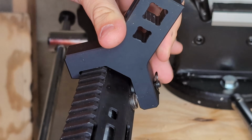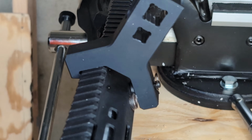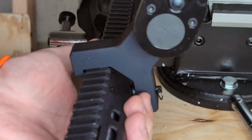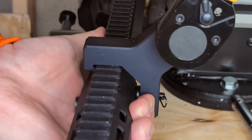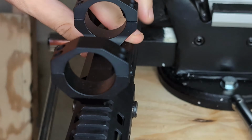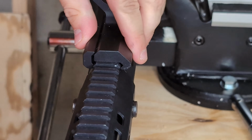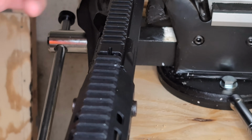All right. So we're going this way. And then I'll set this guy to about 70 foot-pounds. And I just want to keep a hand underneath this while you're doing it so it doesn't bend forward, because the Geissele reaction rod, the shank of it's actually pretty small. And that looks about right. No, you can't really see that. But the bridge is fine. I'll just get one more confirmation.